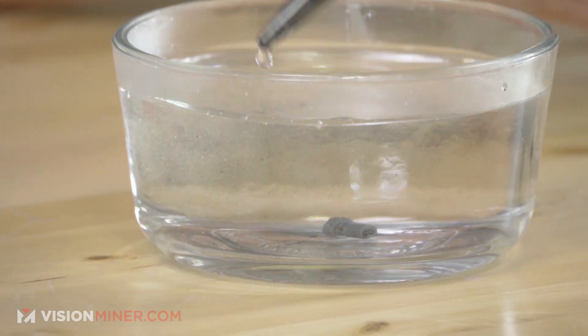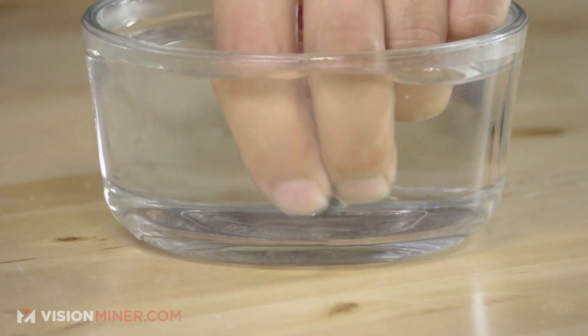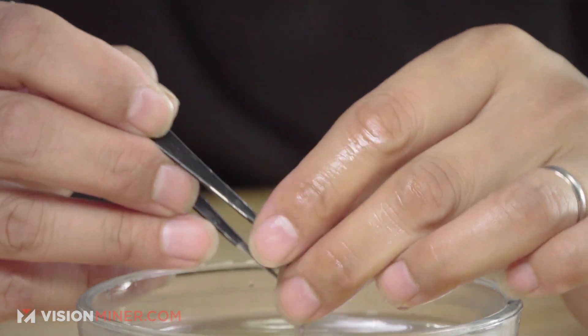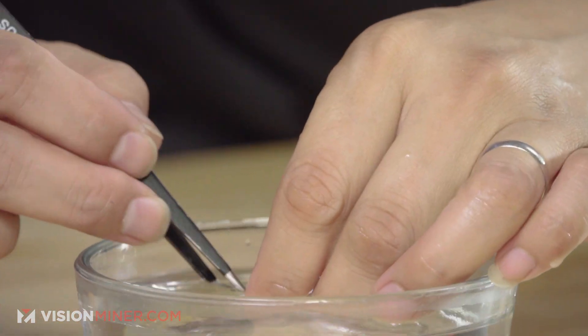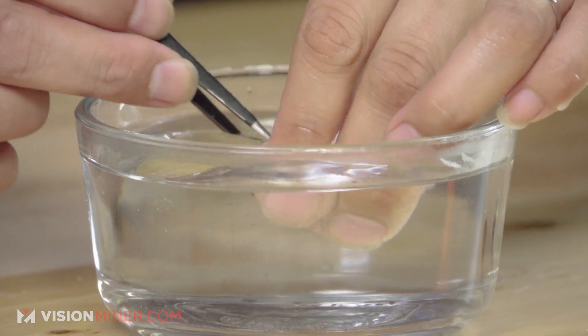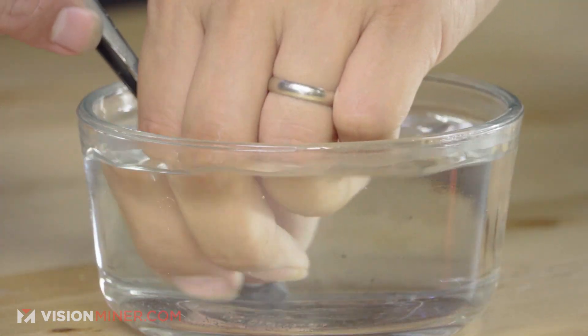Look at that. Now you'll notice down in here there's a bunch of little black gunk and carbonized stuff. So we're going to pull it out and check to see if it's clear. Sometimes it's not fully clear the first time — never be afraid to run it again. Generally, this won't mess up the tolerances on the nozzle. If it's a 0.4 nozzle, unless you're squeezing it really hard, it's not going to deform it.